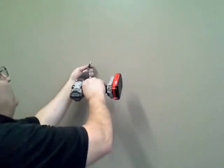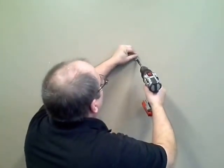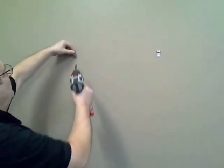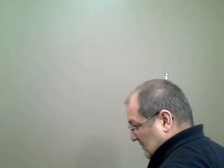Save the drywall screw and pilot your holes. Take the extra step to pilot the holes — don't think you can shortcut it. Because when you hit a stud and the wall is walking all over the place, you're going to be cussing. Get into the habit of using it as a pilot — just until it stops. Don't overdrive it, and do the other side the same way.